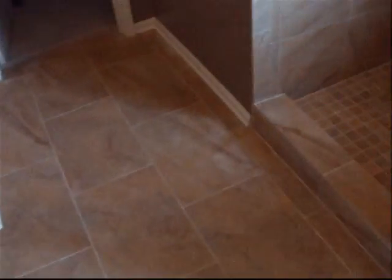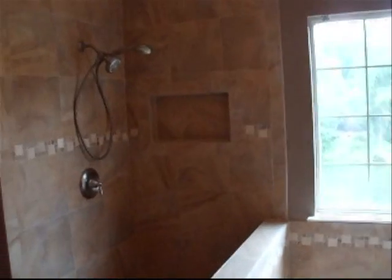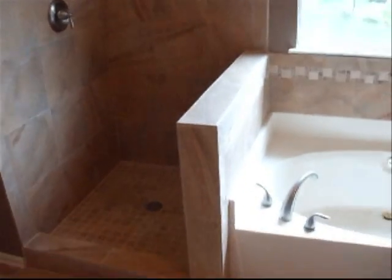I put in the baseboard and quarter rounds — I don't normally do them, but I did it for this guy. He paid me a little extra. There was the toilet area — the floor was uneven, but you can't tell it anymore. The floor used to slope upward this way. Since I followed my tile and not the floor, starting at the entrance, it was kind of thin and the mortar got thicker as I went. By the time I got to the highest point, my thin set was very small. So it worked out really well. That's it — we're done with this job. Seven or eight days from tear out to finished product, and on to the next one.